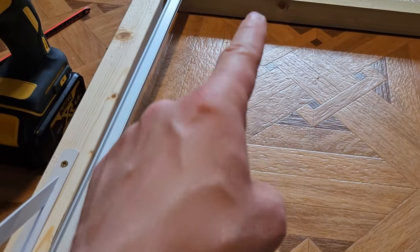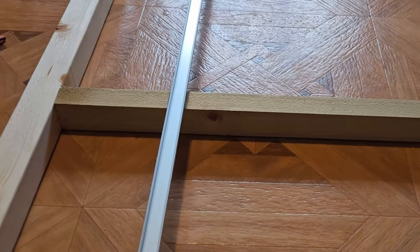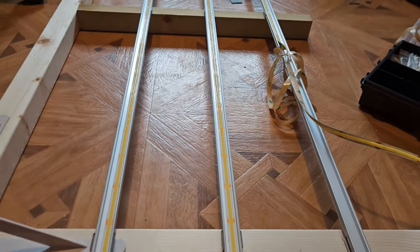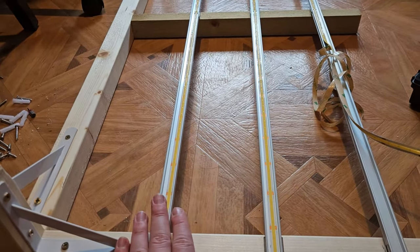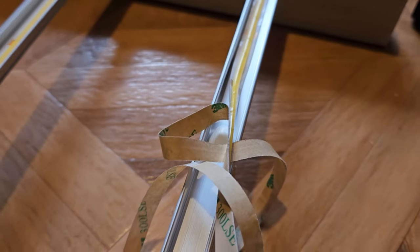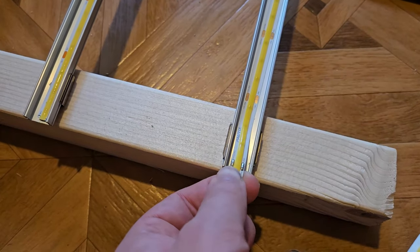I've de-rigged the frame from the layout and it's time to start mounting the LEDs. I've got small clips pre-installed and I've decided to put one on top of the bracket so I can get the lights evenly spaced across the depth of the layout. There are three clips in a line — one in the middle and one with the original bracket — which lets you clip the aluminium strip down into a nice little groove. All three rails are in on 100mm spacings to spread the light out evenly. The LEDs just have 3M tape on the back, so all you do is peel off the paper, push it into place, and then cut at the end where you've got the cut line and the two solder tabs.